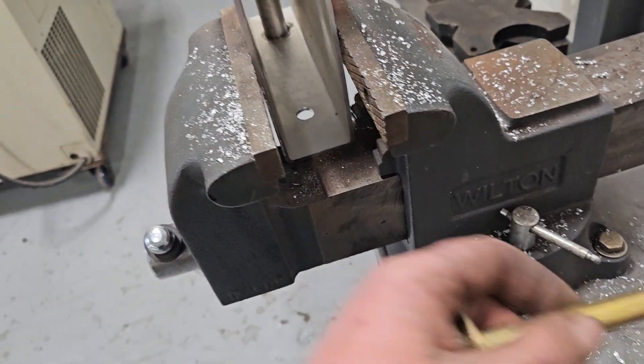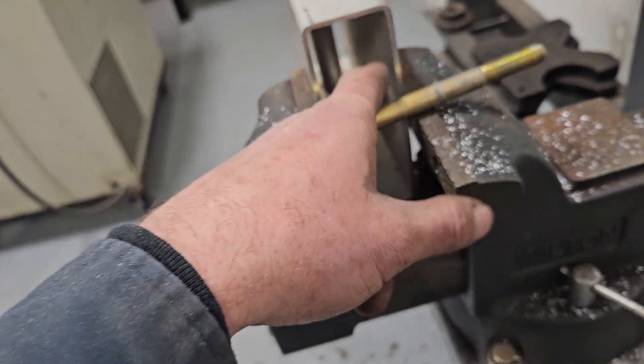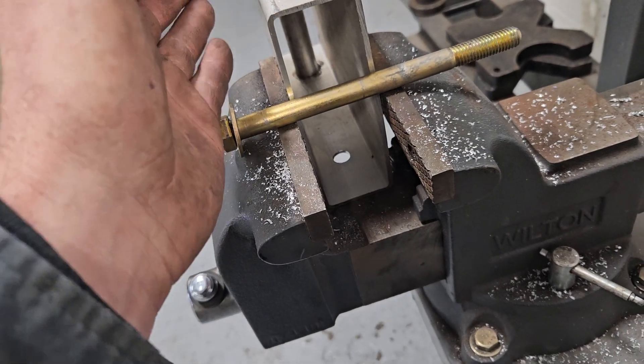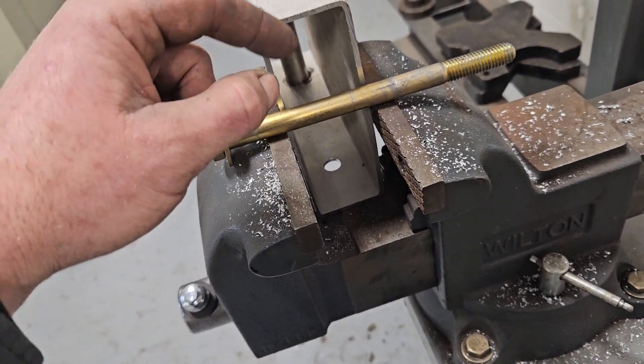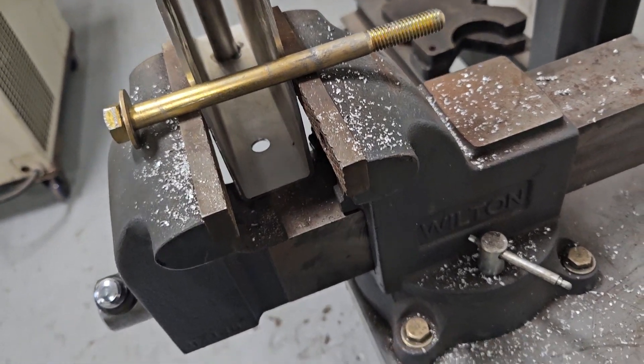A couple things about bolts. Bolts are not made to be loaded like an axle. You kind of can, but eventually you're going to have a shear load on them and they might break, or if this starts walking back and forth, it's going to enlarge the hole — you're going to get cracks propagating, whether it's in steel, aluminum, stainless, titanium, whatever.